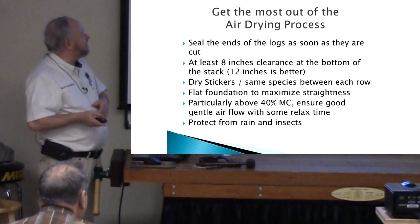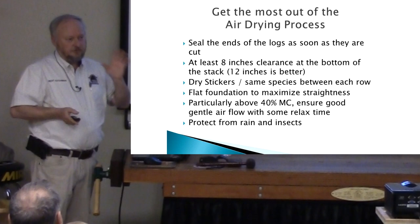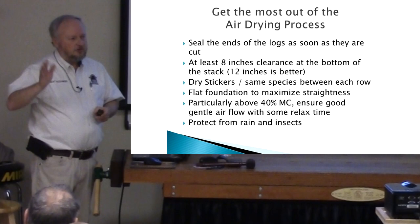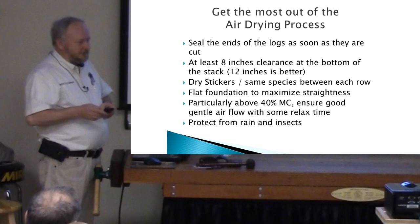To get the most out of air-drying, if you do this yourself, you want to seal the ends as soon as the tree is cut. It doesn't really do any good if you wait a day or two. You really need to do it right after it's cut, and the log is going to be wet when you do that, so it's a little difficult. We found that even latex paint will work, but they make an anchor seal and stuff like that. You basically have to wipe it off and put it on real quick and it'll stick.